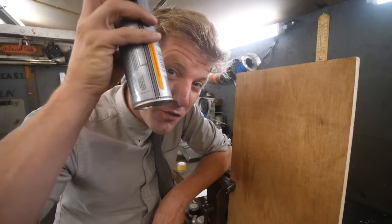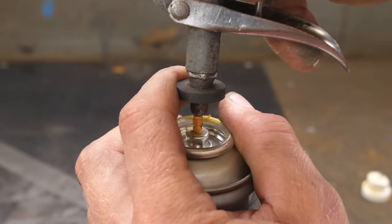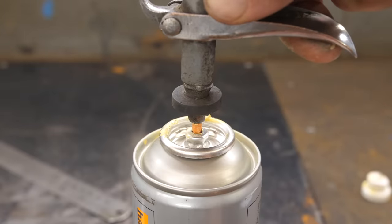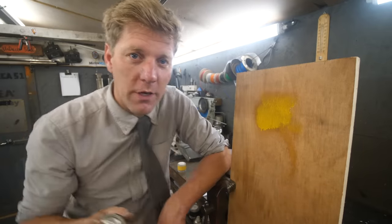You're using your aerosol can but you've run out of pressure, but you know you've still got a bit of product in there. Pull the lid off, get your air line, make the best seal you can, push it down and pressurise it up. Put the lid back on. Works on WD-40, paint — any aerosol can.